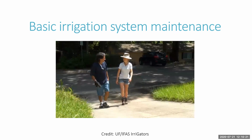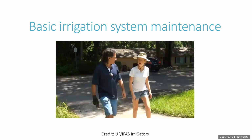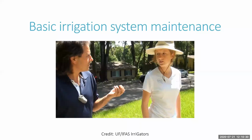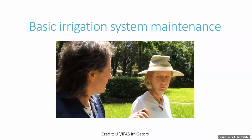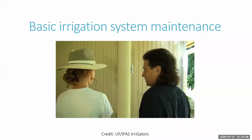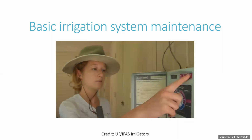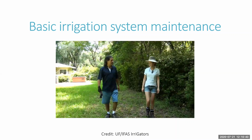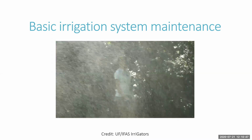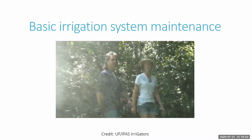You said the least obvious leaks, but which are the most obvious? When something or someone crushes or damages a head nozzle, you'll have water shooting straight up into the air at the highest pressure your system can put out. Gallons on gallons on gallons. I say it's an obvious leak, but none of this is really obvious, unless you do a wet check. A wet check? At least once a season, you or your irrigation specialist should turn on your system manually and check it while it's running. This is the best way to spot leaks, breaks, and poor coverage before the landscape begins to suffer.